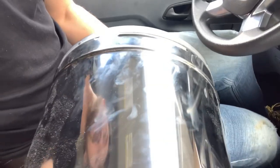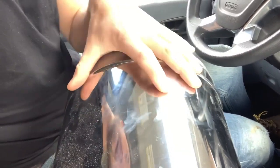Hopefully someone will be able to learn from my many mistakes. As of this moment I have to order another flashing boot that will actually fit this pipe. This is a six-inch triple wall pipe, but it's not actually six inches — it's ten inches in outer diameter. This is a boot for a six-inch pipe, but the outer diameter is ten inches. It's one of those assumed things you must know — it's my fault for not reading the spec sheet, which will say ten inches for a six-inch pipe.